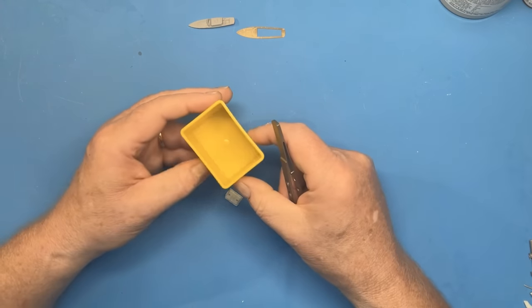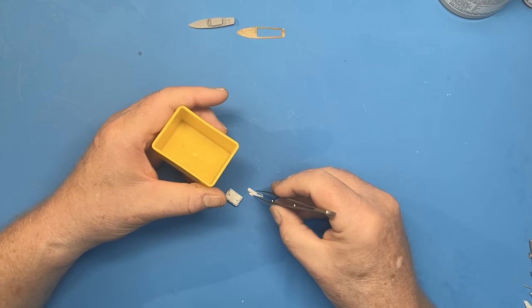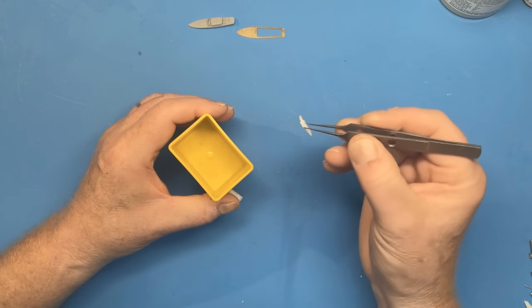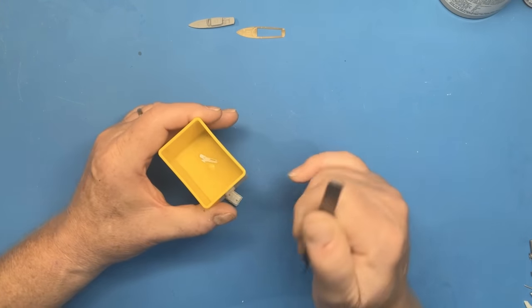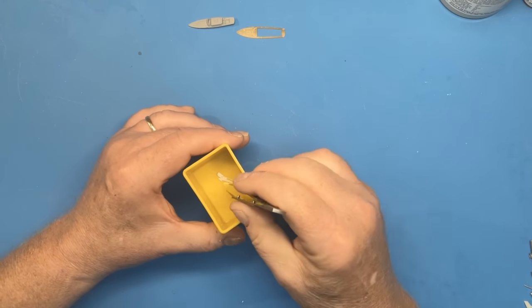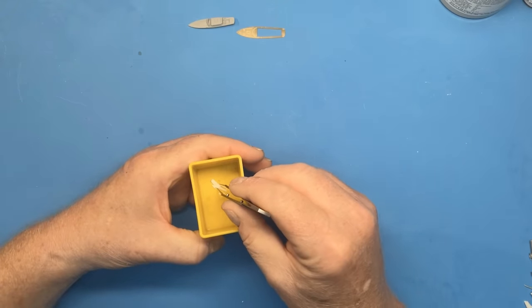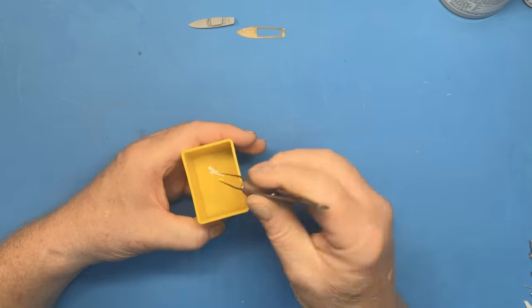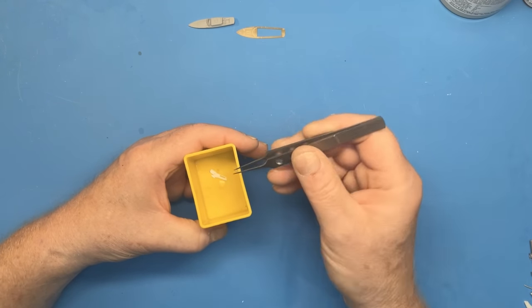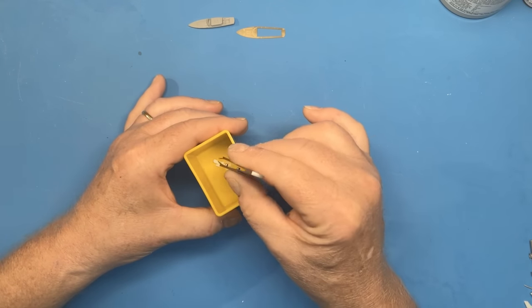So there are three main ways that I've picked up to cast resin. The most simple one is to place the part that you're trying to reproduce on the base of the mould. In this case, I'm just using this cup from a toolkit. It's about 50 millilitres. And what you would do is lay the part on the base, and it's best just to tack it down with some PVA so that it doesn't float in the silicon, and then pour the silicon over the top of it.